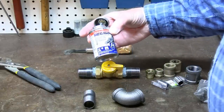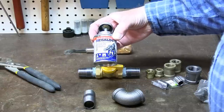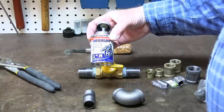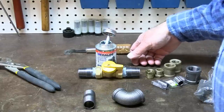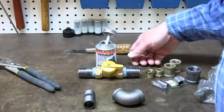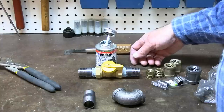I've been using this Megalock pipe dope, which according to people I know is supposed to remain a little bit more plastic and pliable than some of the other pipe dopes on the market. It's essential to use pipe thread dope. Most codes and by practical judgment, you should not use Teflon tape with gas, because any particles of Teflon tape that might get downstream in the system can clog up orifices and really cause a problem.